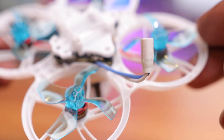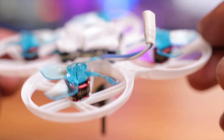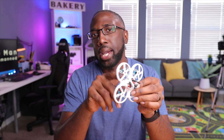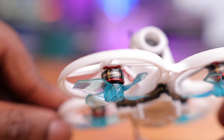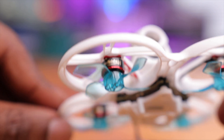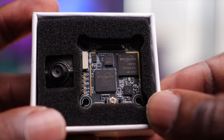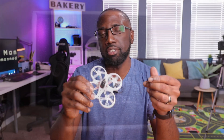The BT2.0 connector is pretty good — it reduces battery sag. Throughout all my testing I never experienced any battery sag at all. That was a concern because I have the VTX connected straight to the battery leads, and if you sag too hard with full throttle you could lose visuals and crash. My understanding is with this Whoop Lite VTX you lose visual around the 2.8 volt region, but I never got it that low.